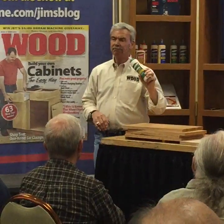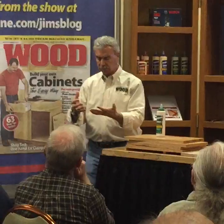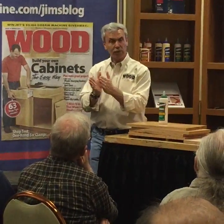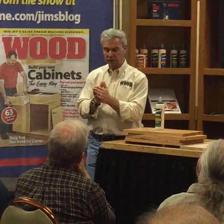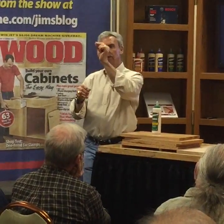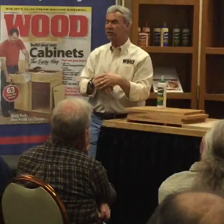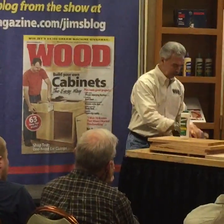Titebond did a little study about 10 years ago or so, because there were so many questions about glue. They said the pressure you need to put a softwood joint together is about 125 PSI, pounds per square inch, because softwood is a little bit more porous. It will absorb more glue through the edges, and it'll leave the glue line that Titebond felt is appropriate. Hardwood is more dense, so 175 PSI there, which again means nothing to anybody until I show you this.